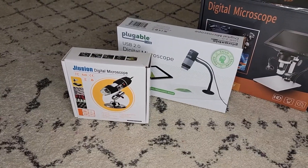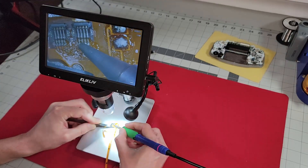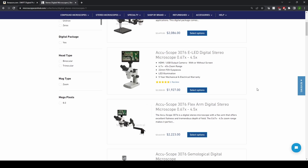I should point out that all the scopes we looked at are monoscopic, meaning there's only one lens, so you don't get any real sense of depth in the image. In certain applications, including soldering, this can be problematic. Stereo microscopes have two lenses which solve this problem, at least when you're looking through the viewfinder rather than at a screen. Those can range from around $300 for a cheap option to thousands for something nicer — and I wasn't ready to pull the trigger on that just yet.